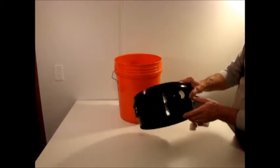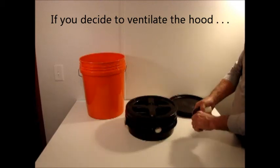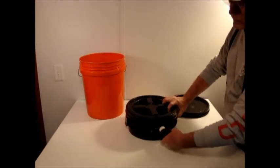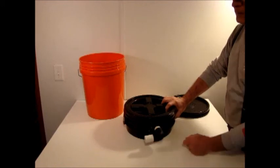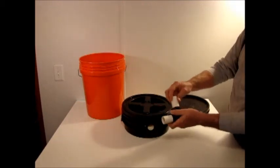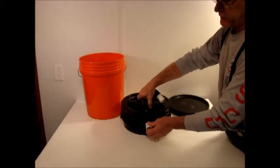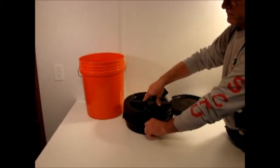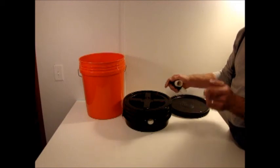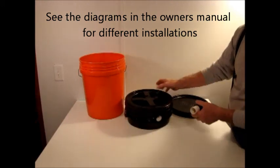Now, if you do want to ventilate the hood using one of these ports, you run your hose to the port. You will have two elbows that come with the package — they fit right into the port and you can angle them any direction you need to run the hose, or you can run the hose straight out. Simply remove the short section of pipe from the elbow and insert it in the adapter, then your hose goes in there. You can vent this exactly the same way you would vent the toilet, having a hose from the toilet to the intake, then a hose from the output up to your ventilation fan.